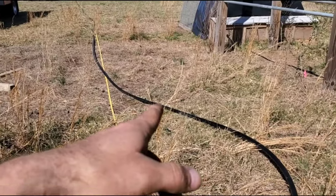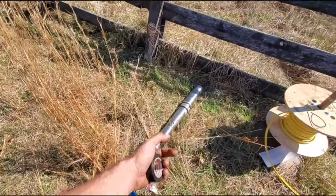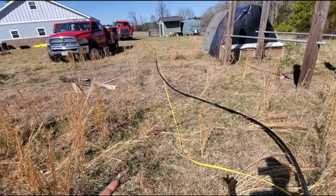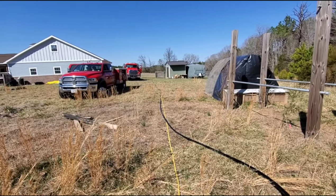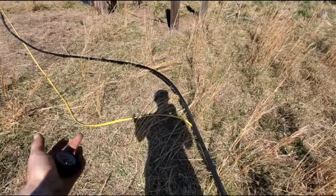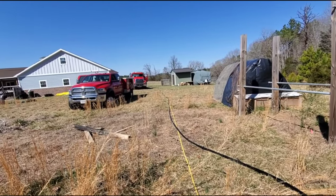Theoretically, 160 psi pipe shouldn't be put in a well any more than about 360 feet. So that's pretty close to where we're going back with it, and we are going back with another five-gallon-a-minute pump. The typical lifespan of a deep-set pump like this is about seven years, and the one they had in there is a 2014 model, so we're going to go ahead and update it. The wire that they had was done correctly — it was just wire that was probably 15 to 20 years old, and it had five splices in it and a dozen rub spots. We went ahead and ditched the wire because that's way too many splices to do this much work — putting a pump in at 400 feet and then finding out it's not working. So we decided to put in a new pump and new wire, and shorten the total length a little bit less than their 450.